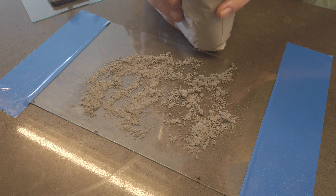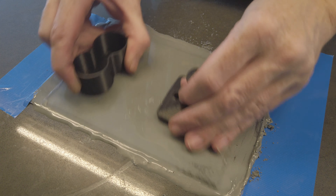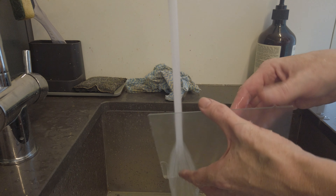That being said, I had recently practiced and learned the art of making my own ground glass when I accidentally broke the ground glass on my Chroma 617. Whilst waiting for the replacement from Chroma cameras, I thought this was a learning experience — why not see if I can make my own. After several failed attempts at cutting glass to the correct size — that's one area I'm still not very good at — I was able to get a piece that fit the camera. Using 600 grit, I produced a ground glass that was much brighter and significantly crisper than the original.